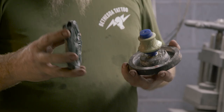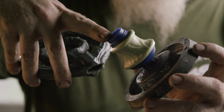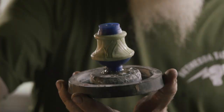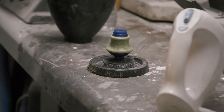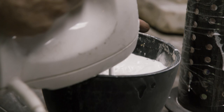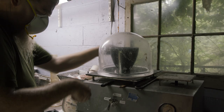I've got the Dawnbreaker waxes ready — Rick's been working for a couple of days on them. It's already fitted to the blade. This is the pommel; I took some machining wax, turned the basic shape, and then Rick tipped the green, cut some overlays and matched it up so it'll match both the guard and the drawings for the sword. I'll be putting a metal flask around the outside, filling it with an investment — basically like plaster — which will then fire. When we fire that to harden it, the wax will melt out leaving a cavity, and that's where we're going to pour the bronze. Then we'll polish the piece and get it together.